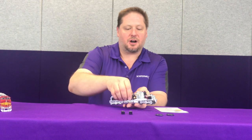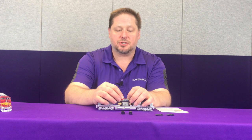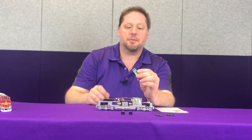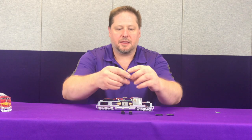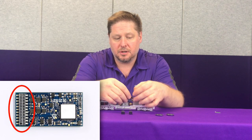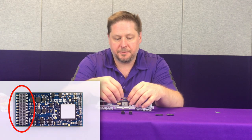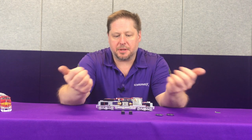Once we've pulled this off, you can see our circuit board is laying right there on top. The easiest thing to do is go ahead and pop this 21-pin dummy board out of the way and install our 21-pin decoder. We want to orient the decoder so that the black plastic header is on top, then simply line it up to the 21 pins and plug it in.